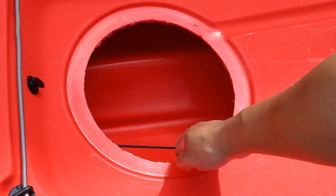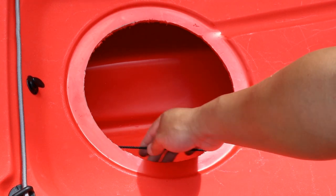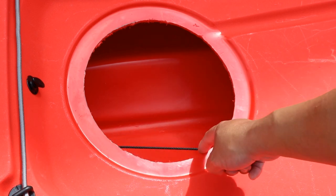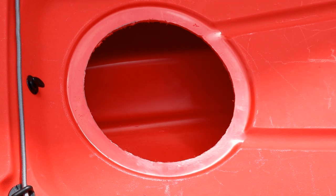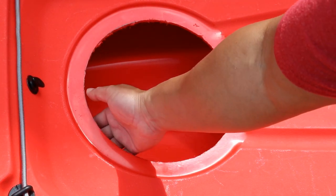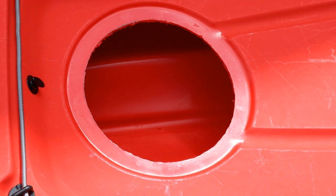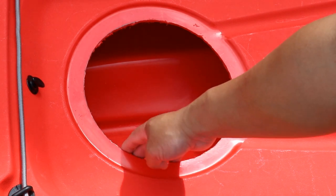This is why it's important that you make sure you drop your rudder. As you can see right here, I have my rudder up and this cable is tight against the hole — so if you were cutting you would actually end up cutting your rudder cable. If you put it down and make sure to take it off the foam in the front, then pull it down so it's not up against the hole, you can cut and won't have to worry about accidentally cutting it. Thanks again to Fox Cross for letting me know about that — it actually saved me, and I really appreciate that.